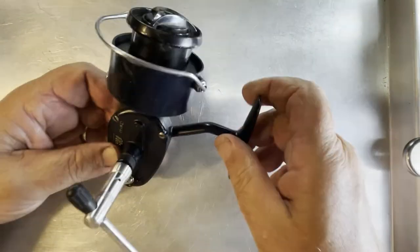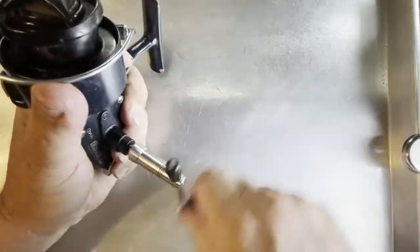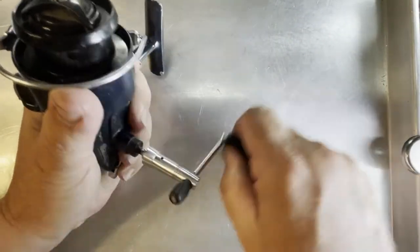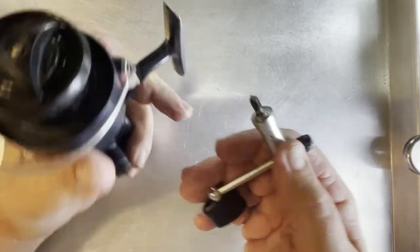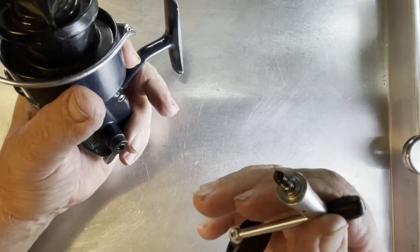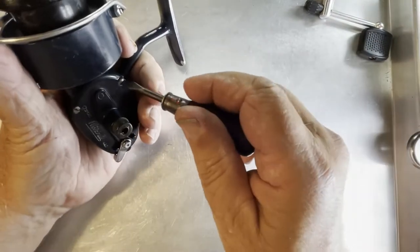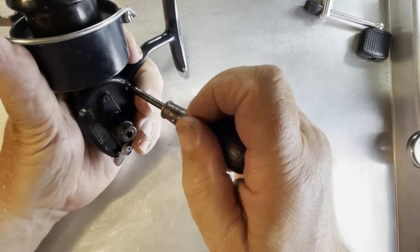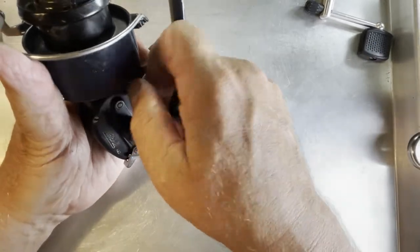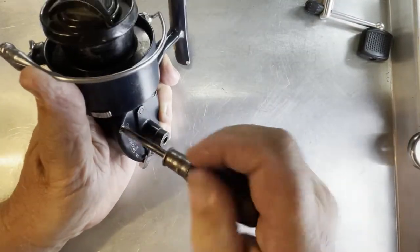So what we're going to do first is go ahead and take the cover off, the handle off. Like I said, it's not the right handle — it is a handle and I could just shim this up with a couple of washers and it would work okay, but I think I have a proper handle for this reel. Let's take out the two screws that are in the side plate. Also, this thing feels really grindy — it's like the teeth are clashing together against each other, so it may not be shimmed properly.